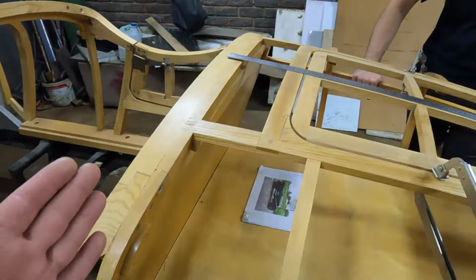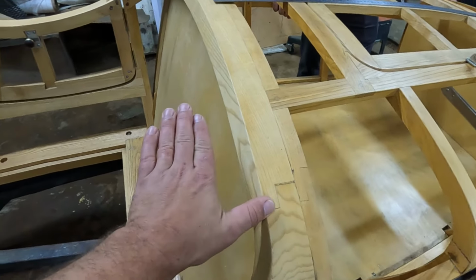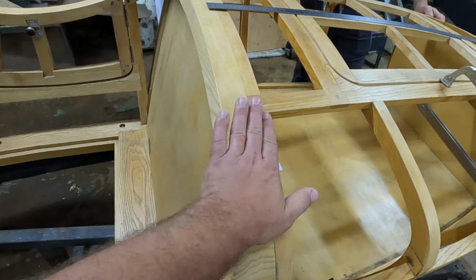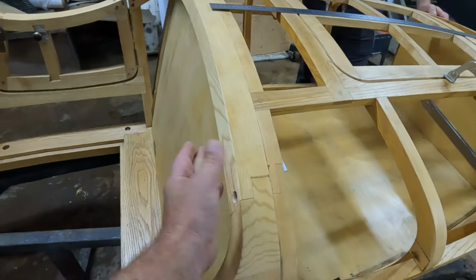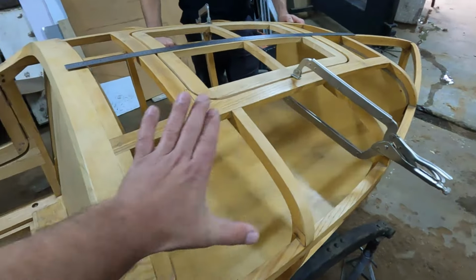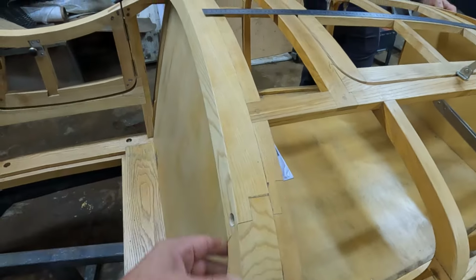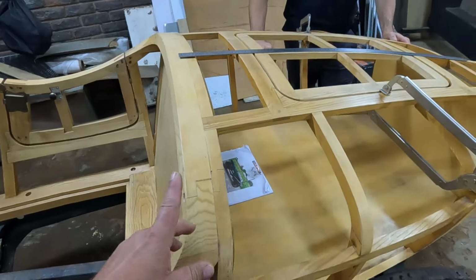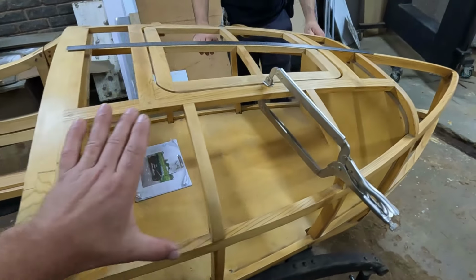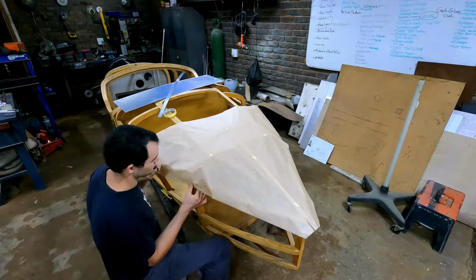And then another thing that needs to be considered is where the aluminium body is going to go after it goes over the edges of this wood, and that is basically going to have to get wrapped around the wood. So we need to make sure that there's enough material left when we've finished making these panels, so that we can then eventually wrap it over the ash wood frame. Well, we're going to get to that in a couple of minutes. The first thing we're going to do now is start off by making a template and then cutting some aluminium and taking it from there.